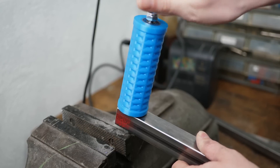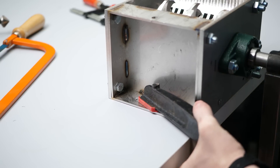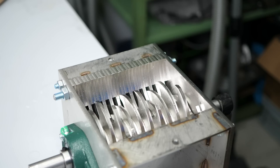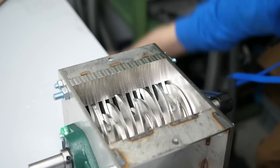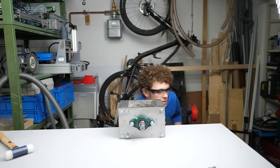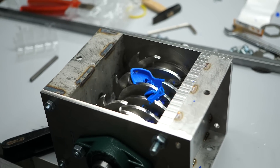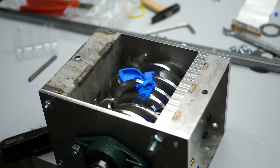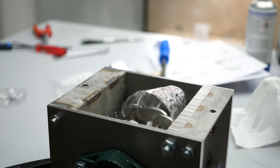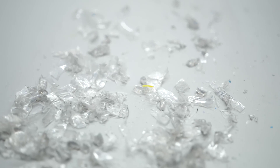The assembly is attached to the shredder, which itself is clamped to the table via vise clamps. Not a perfect solution yet — I need to raise it a little for a material drawer below — but it's a starting point. It really works; sometimes it requires a tremendous amount of force, but it's able to chew through thick bits of material. I might add a decently sized flywheel to add some inertia, but for processing small quantities at a time, it's a workable solution.